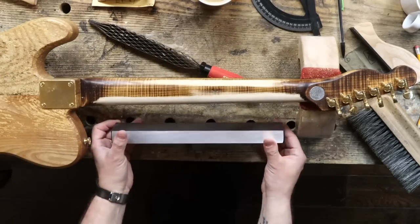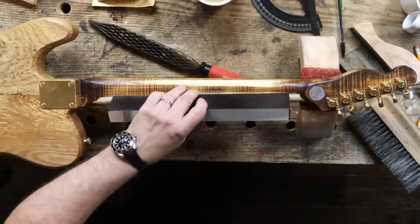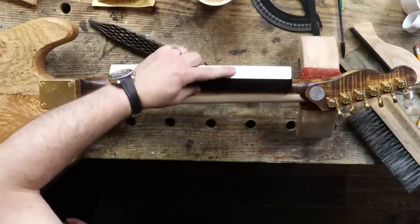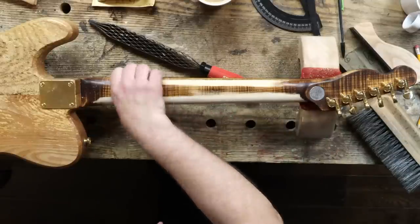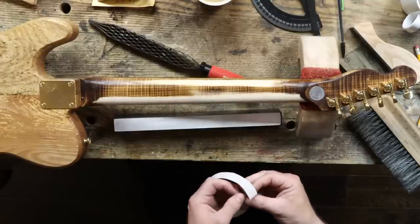Okay, so the other thing is a short straight edge or a leveling beam, and you can use that to see what's happening here. And the reality is I am a little bit high there and a little bit high still in the middle. So I've sorted out my shape, but I want to go in with a leveling beam now and hit the specific spots.